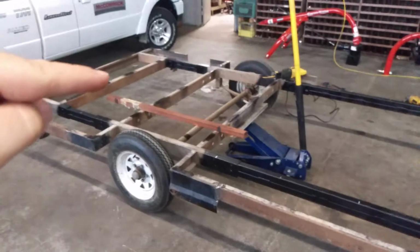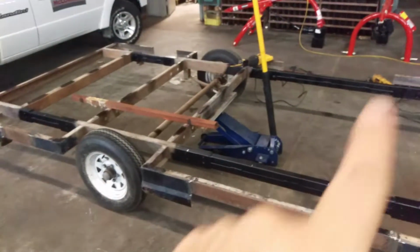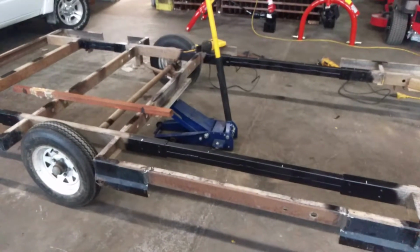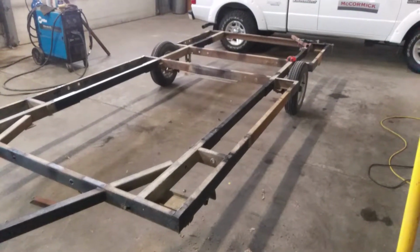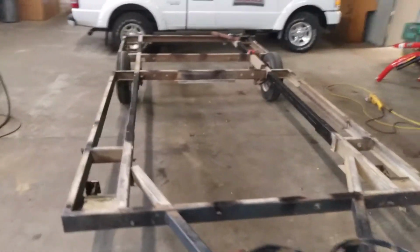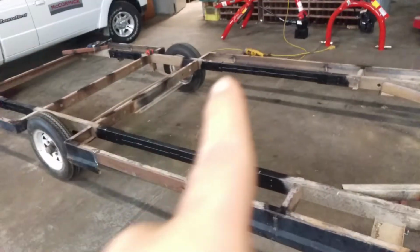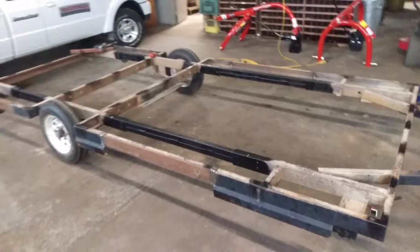We're going to pull out this cross member here. Same thing, 12 inches, 36 inches up front, and that'll have that part completed. There we go, second side done. The expansion or lengthening of this frame is complete. And just with a little bit of pressure I put in the middle when I welded the side rails on, it took the dip out of it.